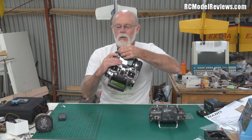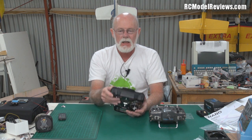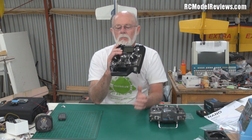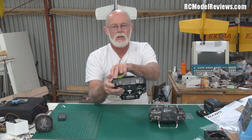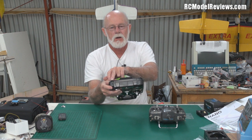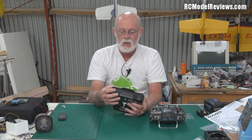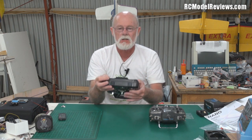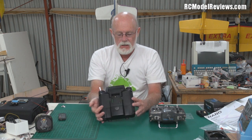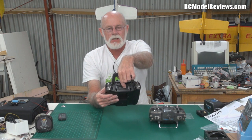There's a little jack where you can plug in a cable — but it's not a standard cable, so you need an adapter. It may just be the JTAG programming pins brought out, meaning you'd still need a programmer rather than just plugging into a USB port. I'll confirm that. On the top it has JR and Futaba buddy-box connections, which is really great for your simulator and buddy boxing — though buddy boxing is useless since you can't reach the trainer switch.